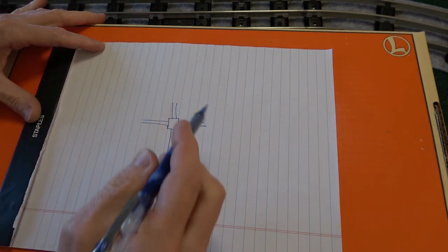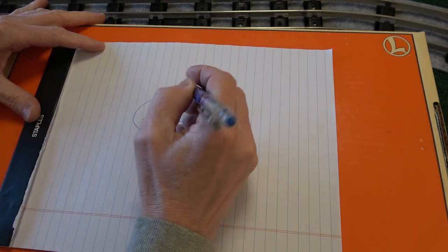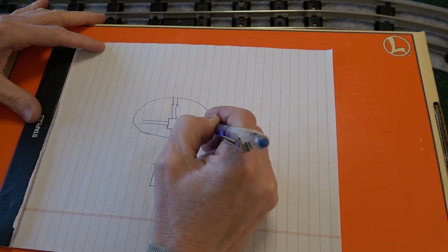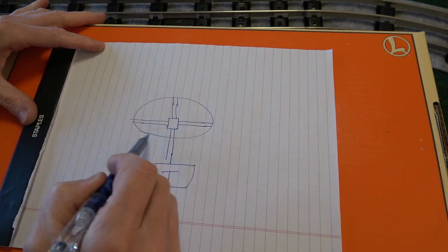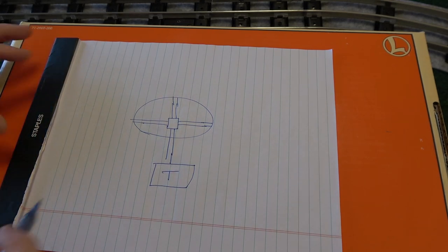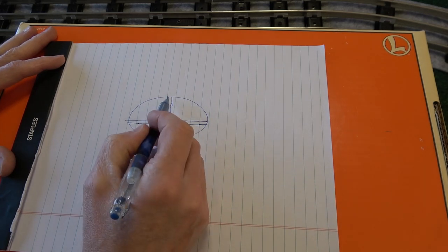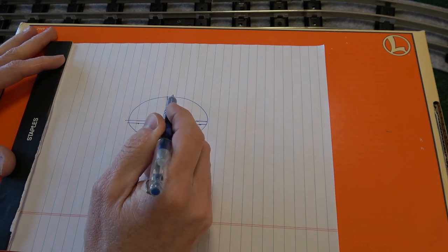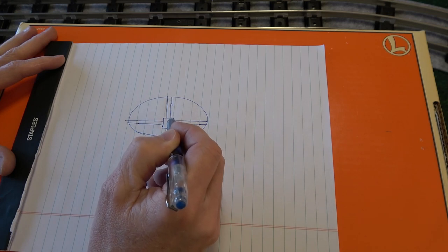So what is that going to do? Well, if you think about it, let's put a circle around here real quick. If this is going to different parts of the track right here, it's feeding, first of all, constant voltage to the different parts, so the voltage is always even going around the whole track. But really for the DCS system, it's all about the signal. In the DCS system, the signal goes out on the center rail to the engine, and then the engine returns a command or a bunch of packets back to the remote and the TIU through the outer rail.